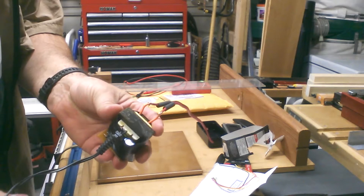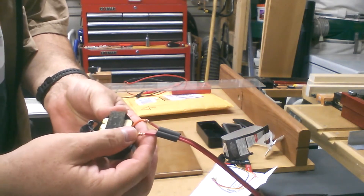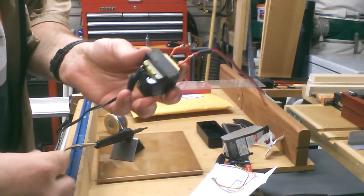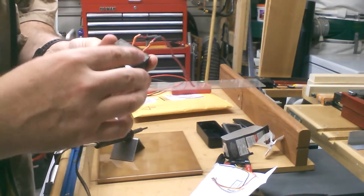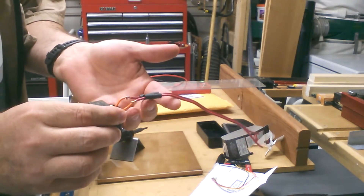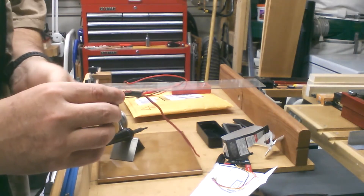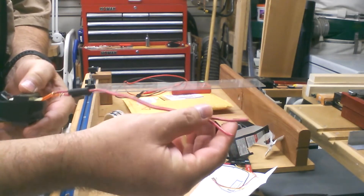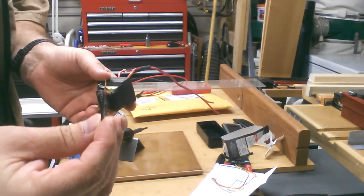This is the interior of that transformer that I'm going to be using. You can see here are the power leads into the transformer from the 110 voltage, and then this is the 12 volts that comes off the back. What I'm going to do is solder this together - you can see I've got some heat shrink tubing on there. After I've got a good solder joint on these, I'm going to cover those up with the heat shrink tubing. This is going to get connected to the power switch inside the lathe and wired up to the digital tachometer circuitry.